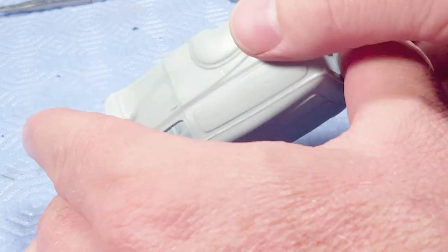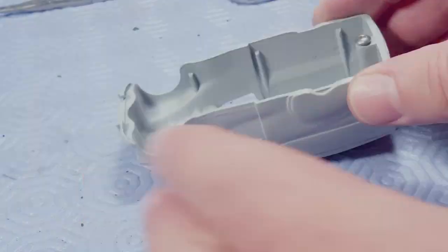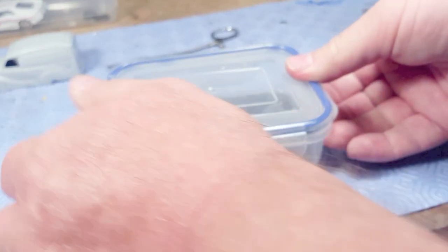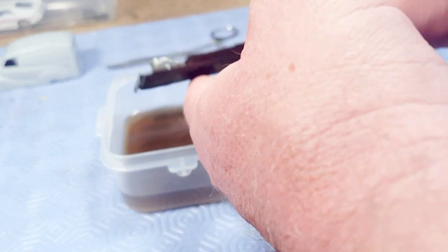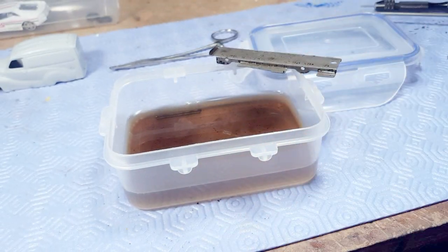The tap is a 4-40 Osborne Blue Wizard machine tap. I like to use a machine tap because I don't have to back it off every quarter or half turn — it pushes the swarf in front.